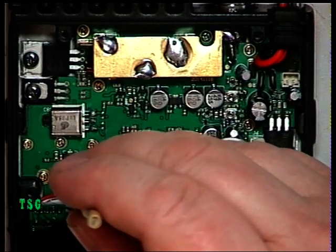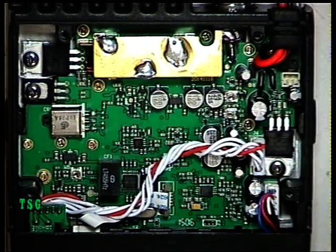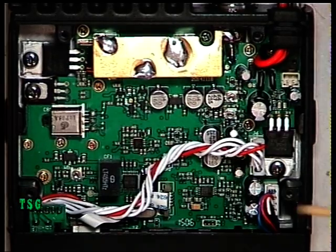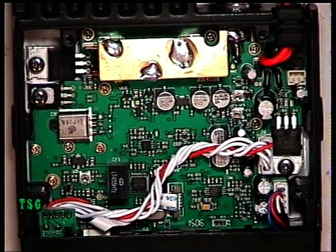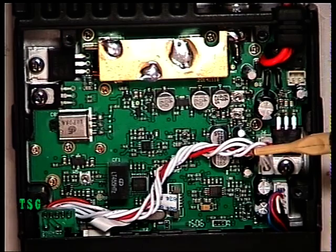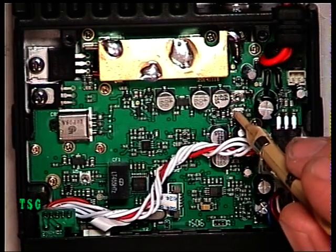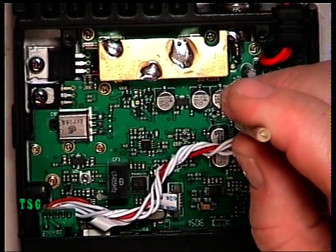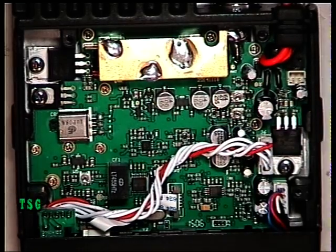As it comes out of the box, deviation is 1.4 kHz. What we need is between 2.2 and 2.5 kHz, so I'm adjusting that — we've now got 2.2 kHz. Without this adjustment, it sounds very quiet and people complain it's like whispering. The second preset we've identified controls power: the radio is doing just over 3 watts out of the box. I'll knock that up to 4 watts using that lower of the two controls.